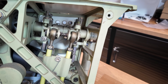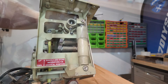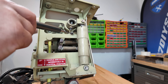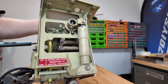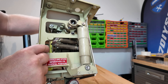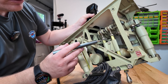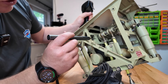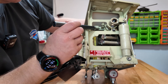Okay, so inside we've got the roll channel - this is what's operating now. So for the roll channel we've got this damper, and as I said that's leaking, but it's still quite smooth, so it does slow down the return. Here we've got four - actually there's three tension springs: two here and a big one at the back, and that sets how much pressure is acting on the stick. Around here we've got the roll control rods, loads of adjustment on all the stops left and right, and you probably could make these springs much stronger by tightening the stops.